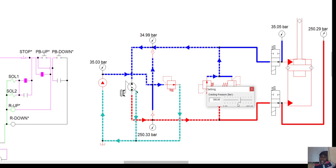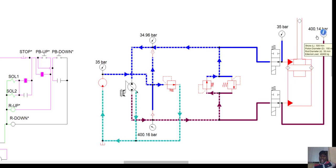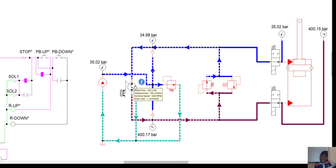We can decide to increase the lifting pressure — the cylinder pressure — to 300 bar, and you can see the result immediately. We can also increase to 400 bar depending on our cylinder specification and target load. The pressure is about 400 bar on the high pressure side, and on the low pressure side we're only seeing feed pressure because most of the pressure is returning to the suction for the pump to re-pressurize. Our pump has a drain line for any overflow or excess fluid.